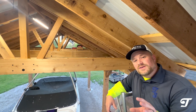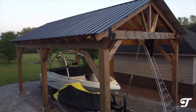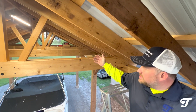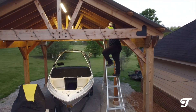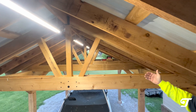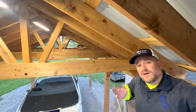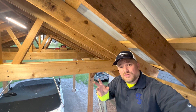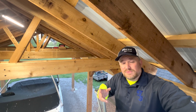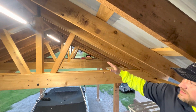Let's take a closer look at the roof material and how it looks. We have five trusses for a 28-foot deep structure — 30 feet total with a one-foot overhang on each side. The trusses have four-by-four braces in between. With rough-cut cedar you get a true two-by-eight, two-by-ten, or two-by-twelve; with regular pine it's just a little over an inch and a half. So this is genuinely thick wood. You can also see how well the lights illuminate everything in here.